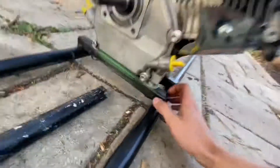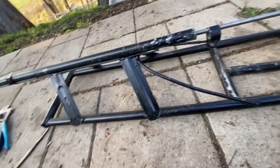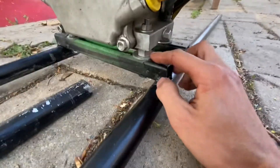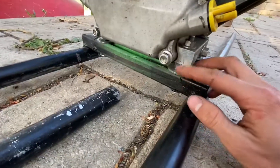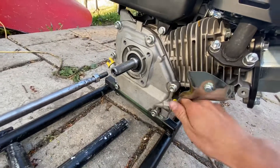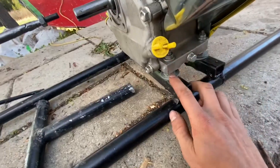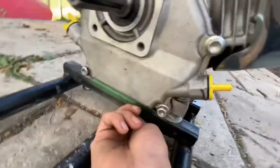When this was constructed, I placed it on bolts. So you take off the bolt, you would put the washer if you need to lower the engine or if you use a different engine. You can lower it, you can add more washers to make it higher, and you move it left and right with the slot.